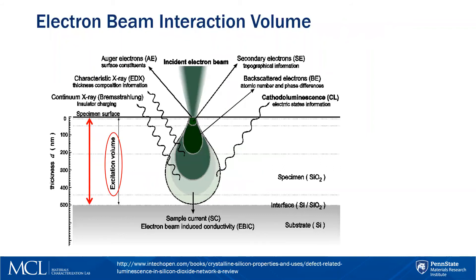All of this is predicated on an excitation volume and interaction volume between the electron beam and the sample. As the electron beam comes down and hits the surface of the sample, you don't just interact with the surface — XPS techniques are surface sensitive, but in this case it's more of a bulk technique because you excite this whole volume, which could be as much as one or more microns. All kinds of different signals get produced: secondary electrons, backscattered electrons, cathodoluminescence, continuum X-rays, and Auger electrons. But the one we really care about is the characteristic X-rays, which give you compositional information.